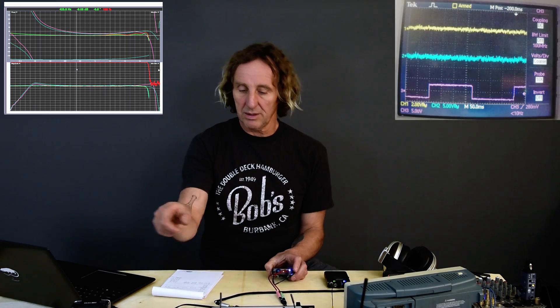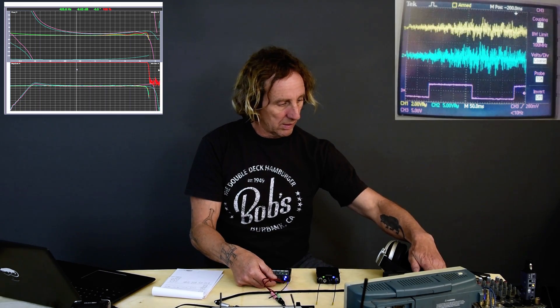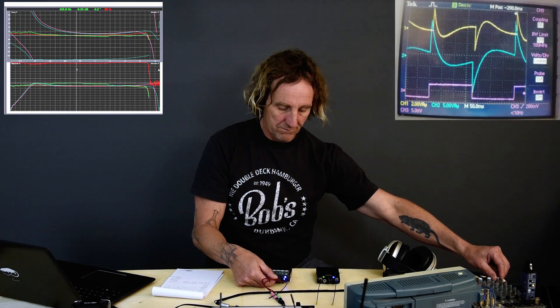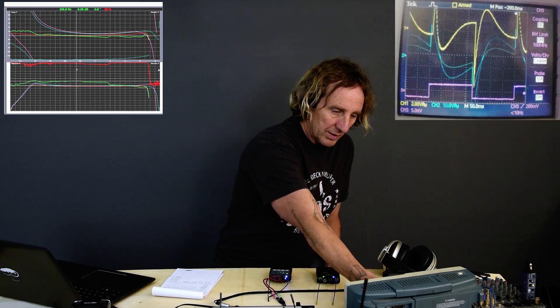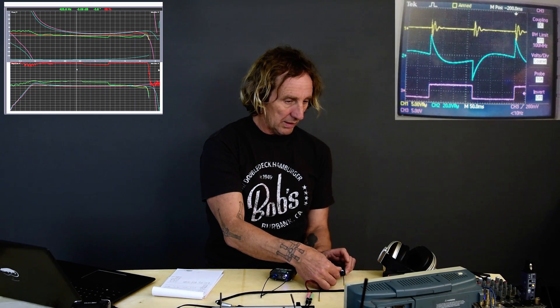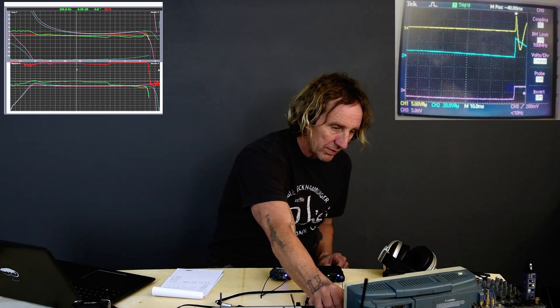For that test I might clip it but we'll have to look at it on the scope. We'll put that on pulses because it's more fun. Now I'm clipping the input to the Lectrosonics and we can see those waveforms are pretty big. I'm going to crunch them down and then plug into the Shure. We can look at the Shure waveforms because I didn't really do that before — and the Shure waveform will look quite different as we're seeing here. The Shure waveform, instead of looking exactly like what's sent into it, it's going up and spreading out.